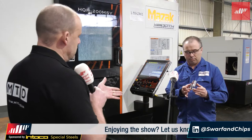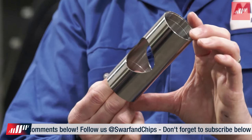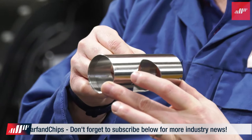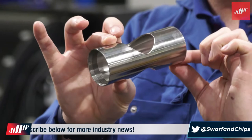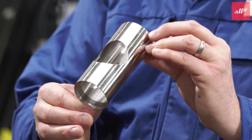Let's look at this other part, because this is really fascinating. I looked at this and thought, why wouldn't you make this out of tube? But there's a good reason not to. It's made out of solid bar. We tried tube, but the problem is getting tubes in the right sizes, and the properties of tubes machine completely differently to solid. Actually, to stick a U-drill in and machine this out of solid doesn't take very long at all in comparison to the cost of the tube, and we're able to get a better finish making this out of solid than we would out of tube.